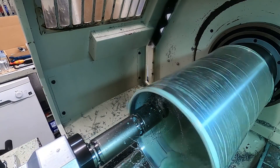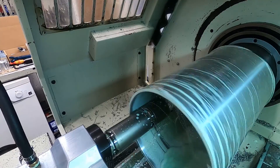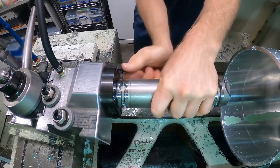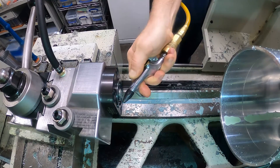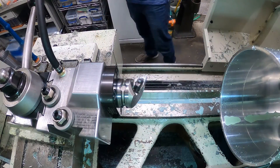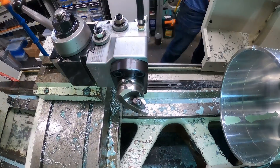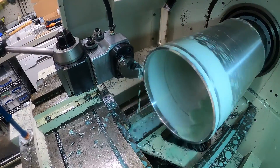This tooling is also more rigid and bigger in diameter than any traditional shank tooling I'd be able to use in this lathe, because the holders for the Aloris tool post go up to inch and a half. At the auction I got two different sizes: KM 50 and KM 40. The KM 50 is two inches in diameter, where the KM 40 is inch and a half. So the KM 40 does line up with the max size I was able to do traditionally, while the KM 50 is just that much bigger.